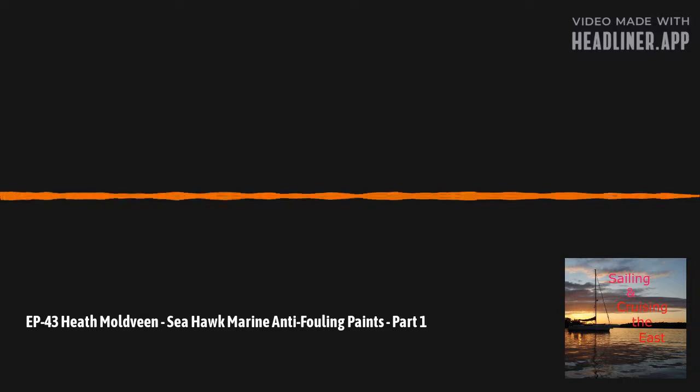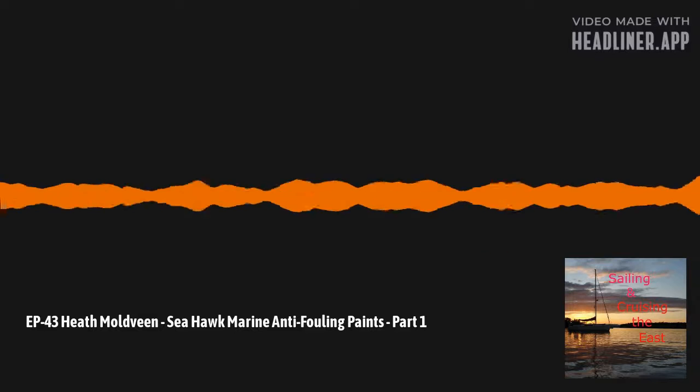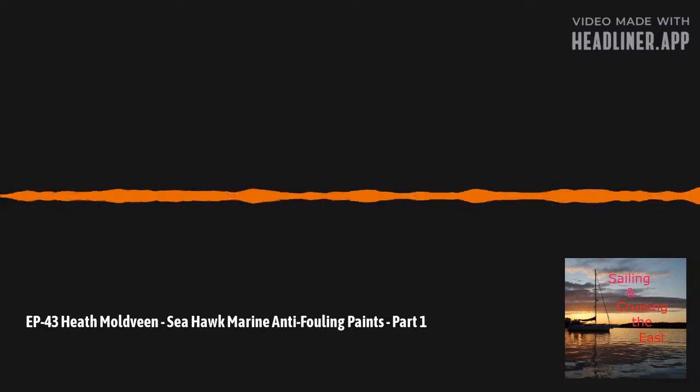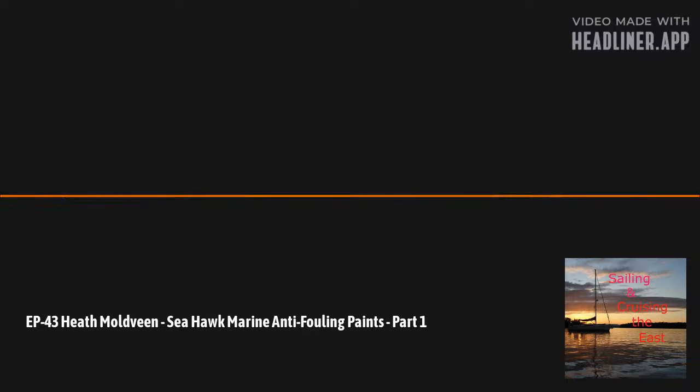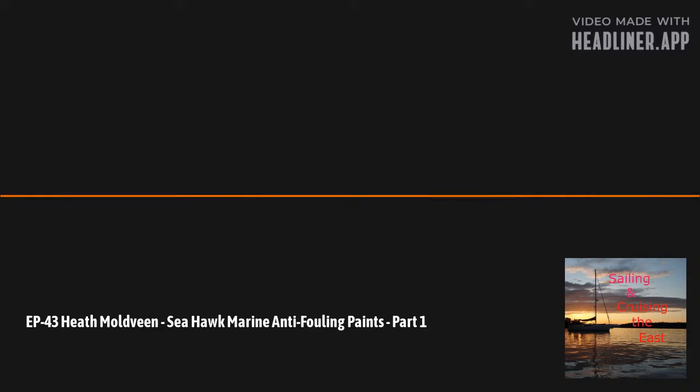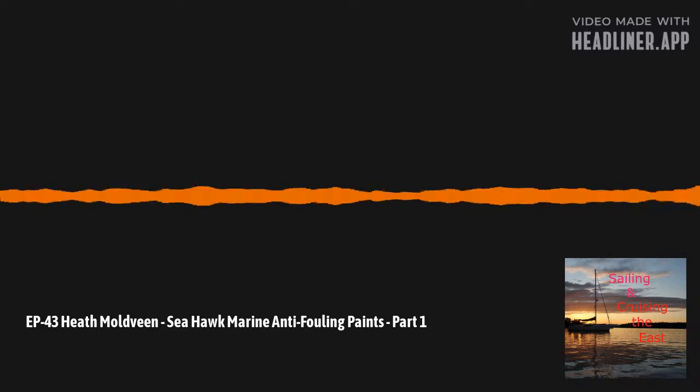We can do that with our premium products like BioCop TF or Color Coat. We're able to do that with those products very, very well. However, there are some specialty paints out there from other companies like Interlux, and they make a traditional racing finish, either Baltoplate or VC Offshore. And those are a vinyl type product, very, very thin film, incredibly, incredibly hard. The trade-off with that is that the performance may not be as good.